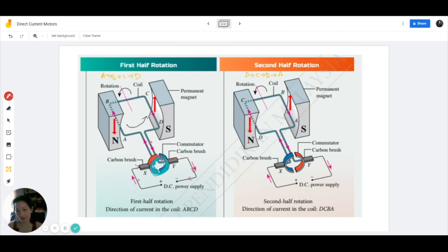Now even if the current splits — that is, some flowing through the commutator and some through the coil — it also reduces efficiency. Because instead of having all the current flow through the coil, now you have some current flowing through the commutator and some through the coil. As we already know, one of the factors which affects the speed of rotation of the motor is the value of the current. If the current is reduced, the speed of rotation will also be reduced, hence reducing the efficiency. And that is why we cannot have a completely circular one-ring acting as the commutator.